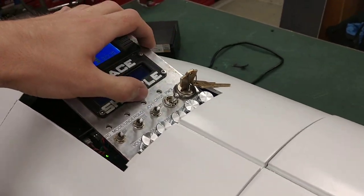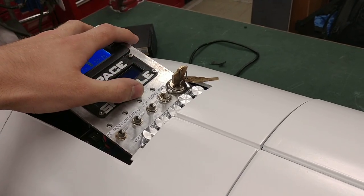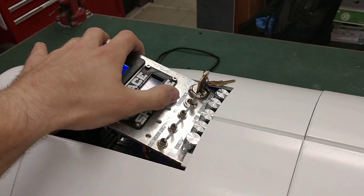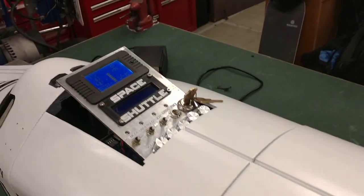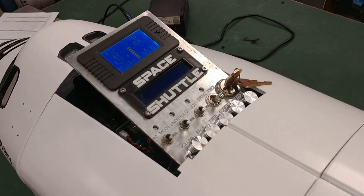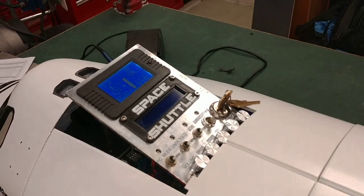We have the joystick up and down enable switch which will actually lift the joystick — the main user input — up and down. And then we have a drive power switch which is what switches power to the VESC. This allows separate modes where the only thing powered are auxiliary electronics versus power electronics for safer testing. These knobs down here are different amplifier settings: volume, bass, treble, sub frequency, and sub volume adjustment that allow for tuning of music.